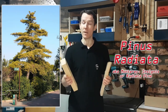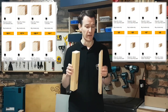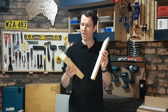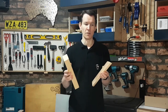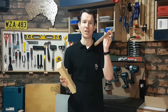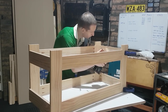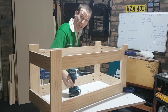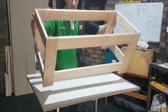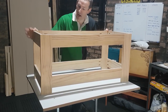Pine is really cheap and widely available in all sorts of sizes and dimensions — usually called dimensional lumber overseas, or dimensional timber. There are two main varieties I want to discuss. This one here, that looks all clean and shiny, is called DAR — dressed all round — otherwise known overseas as surfaced four sides, S4S. There are so many different shapes and sizes that you can build huge numbers of woodworking projects just with these things. I have done so on several occasions.